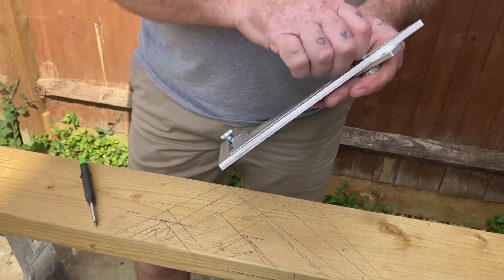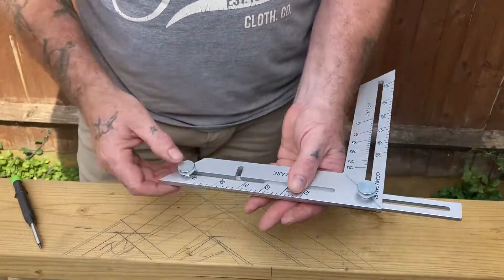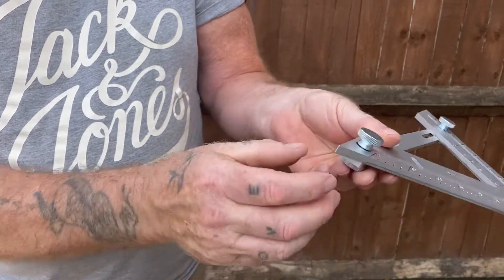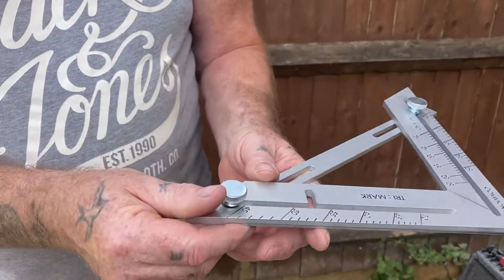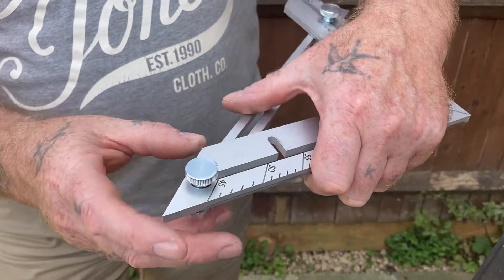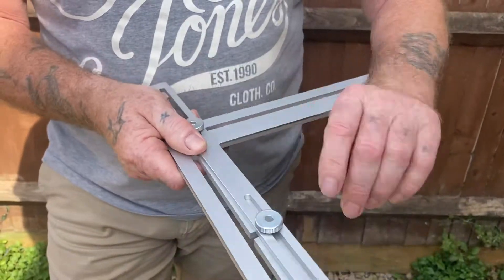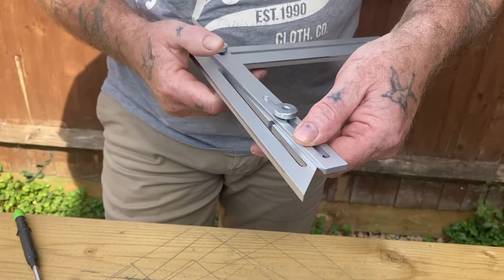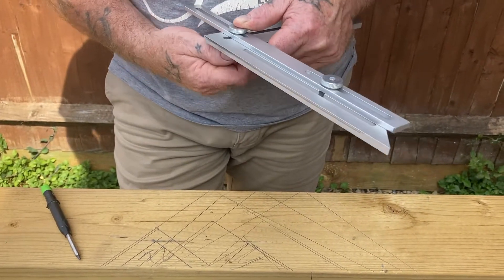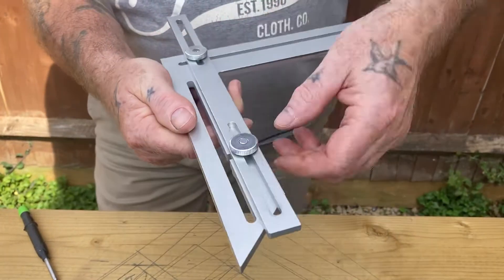The other feature it's got: if you're doing a lot of roofs, obviously you'll have to do wall plates for roofs. So that's where this little slot comes into play. When we're doing pitches, this arm sits in this little recess — there's a little recess there — and that stops the arm from coming out of position. You take it out of the recess to get into this slot, and spin the arm right up to the top. Turn it over, and you want to get this bar in the centre of the bar — quite simply like that. So you can see this is central.